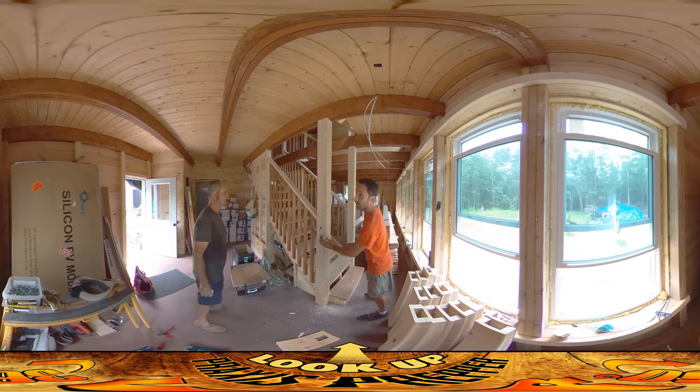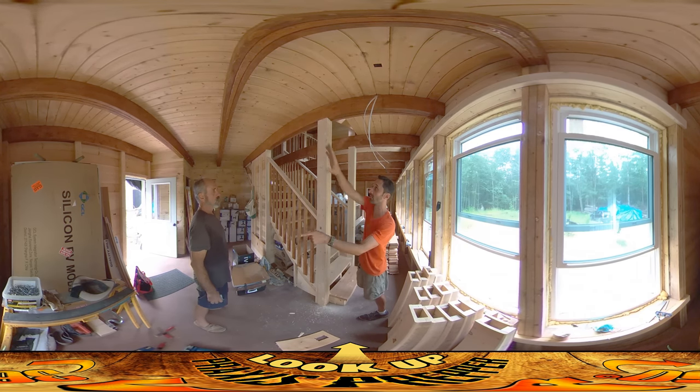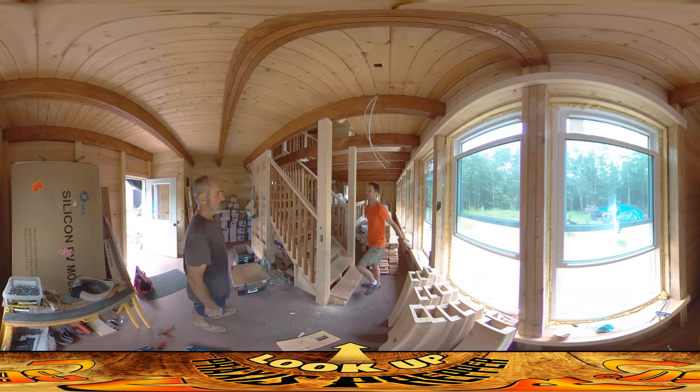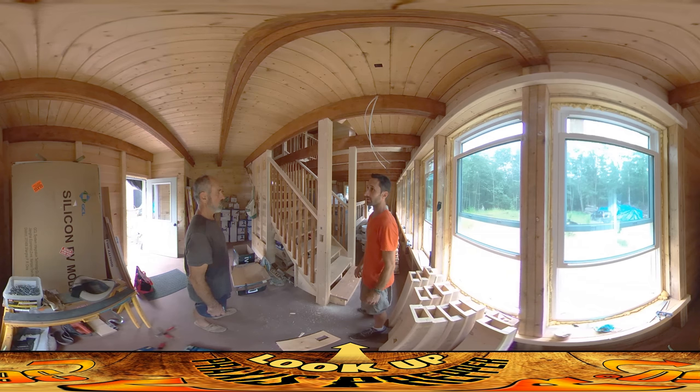You've got one switch here that'll act as a three-way switch with another switch there for this area, and then there'll be another one on this side as you're going up. It'll be a six-way switch — see how the wiring goes on that. There are actually five switches on that. Five switches, one light, which they call a six-way. It's confusing because one of the ways is the light. The end switches are three-ways and the ones in between are four-ways, so not sure how it adds up to five. I don't know — I don't need to understand, because you're doing it.